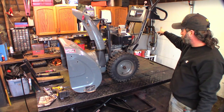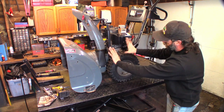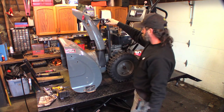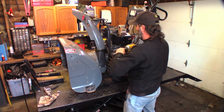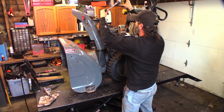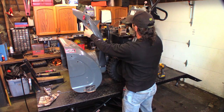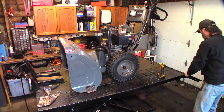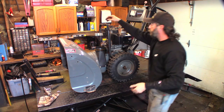I need to get a support under the back handle here because I've got to pull a bolt - one bolt here and one bolt matching on the other side, and then this unit should split open. But let's get the chute off first because it's connected with cables. Should be able to just take one nut off and lift that chute right off. 9/16ths it is - that's the bracket that holds the cable assembly - that just flops out of the way and this should come off. Out of the way.